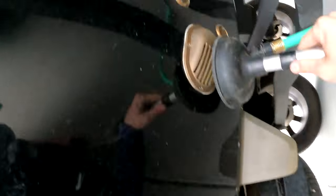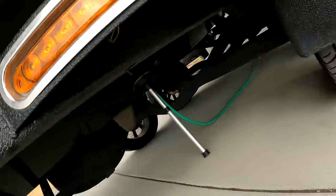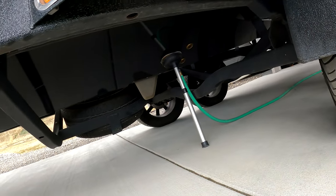It just needs to have some water going to it. You kind of pull it out to the side, get it tight, and then put it up underneath just to where it's somewhat tight. I'm going to get in the boat — usually there's a valve where that intake comes in. Sometimes they have a shut-off when they winterize it. I think it is shut off right now because it's got antifreeze in it. I'm going to make sure that's open.